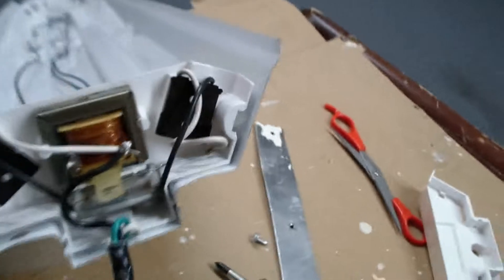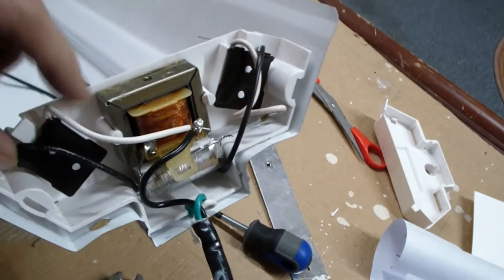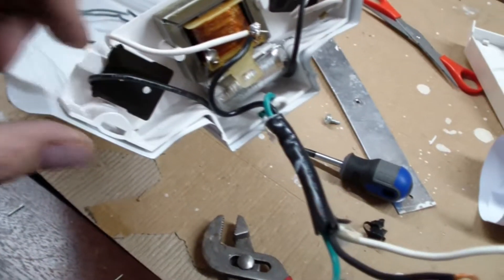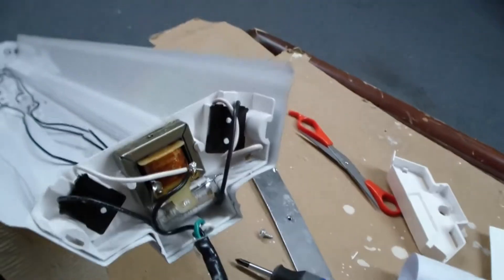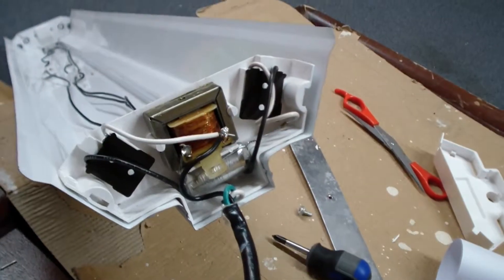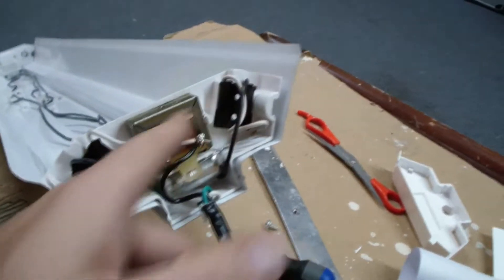Let me show you the good news. The bad news is there's no way I'm going to use those new lamp holders I bought — I wasted 69 cents on those. But the good news is these are not shunted sockets. As you can see, there's a black wire and a white wire on each end, which means they're not shorted together. We've got convenient black and white wires, and the line-in is also a convenient black and white wire, so it's just a straight hookup. We cut off the wires going to that far end since they're not going to be used anymore. We'll hook up the line — black for line, white for neutral — to those two connections.